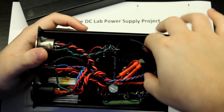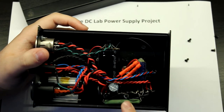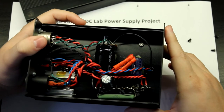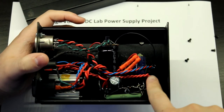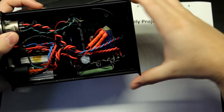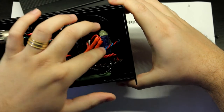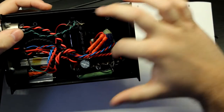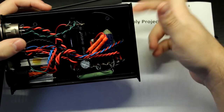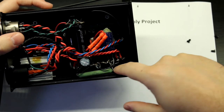Now, for the second, the low voltage stuff, the windings probably come somewhere around in here. There should be another bridge rectifier. And there isn't. There's just a... oh, it's discrete. Here it is. So here you have a discrete bridge rectifier. There are four 1N4007s here, going into a 4700 microfarad capacitor at 25 volts. So this would probably be at around 12 point something volts here, 13 volts, since it was a 9 volt transformer. Then we have a very big 5.6 ohm 10 watt resistor here.